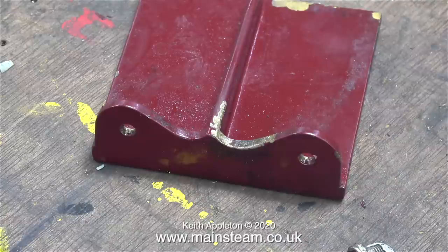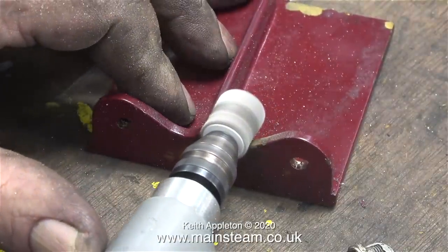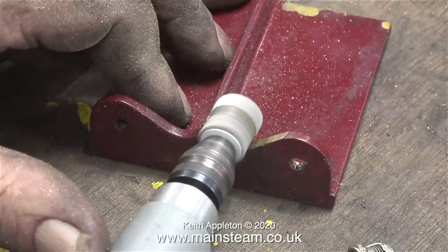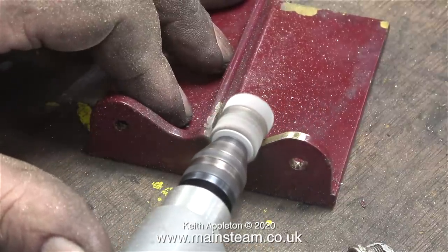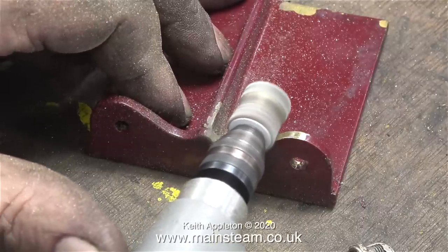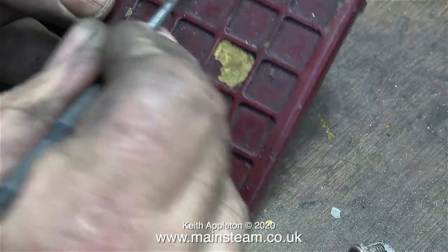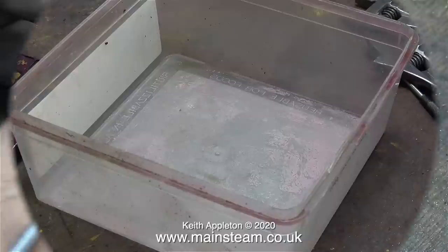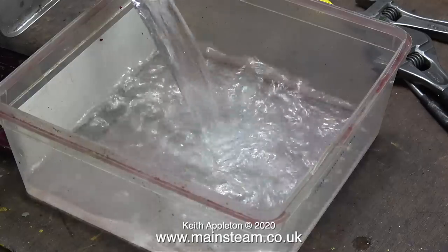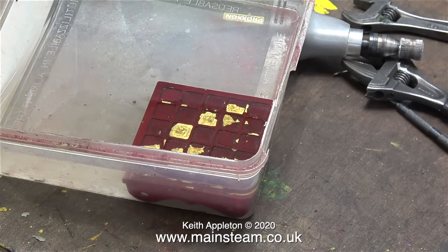This is the footstep that I need to fasten back in place on the side of the bunker once the pipe is in place. But before I do that I'm going to paint it, and before I paint it I'm going to enlarge this part of it so it will not touch the pipe at all — and maybe I'll be able to get the union nut out of the hole should I ever need to take the pipe off again, hopefully never, because it's a really tricky and fiddly job. On the other side of the footstep the paint was very flaky, so here I'm starting the removal process with my scriber, and then, as you've seen many times, with a polythene tub and some cellulose thinners or lacquer thinner — this will dissolve the paint and make it much easier to remove.